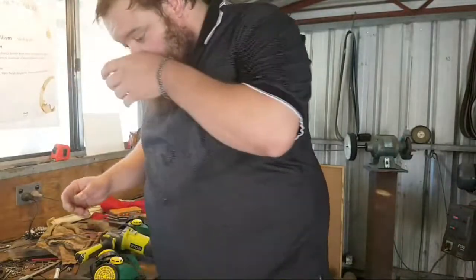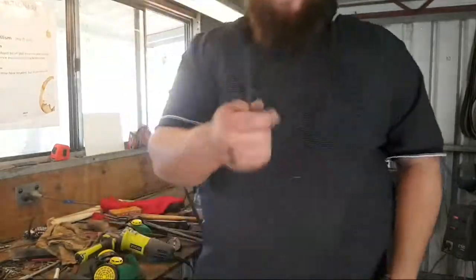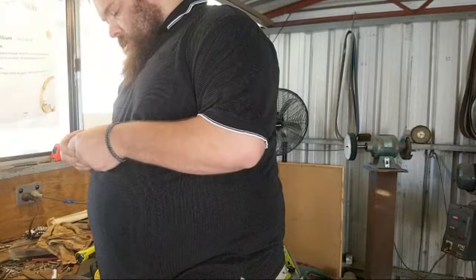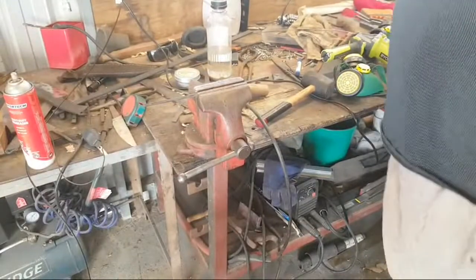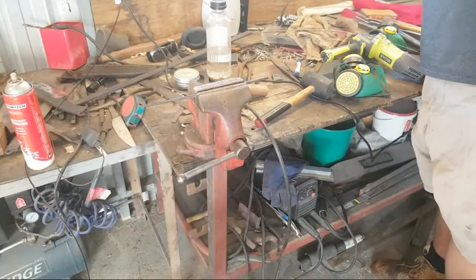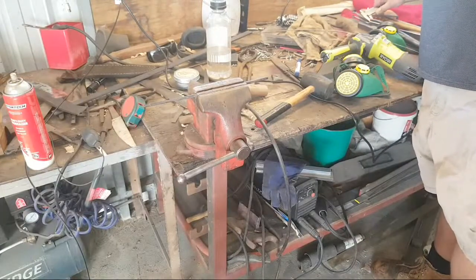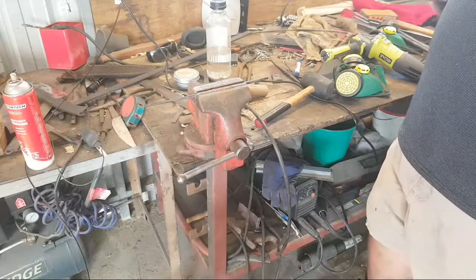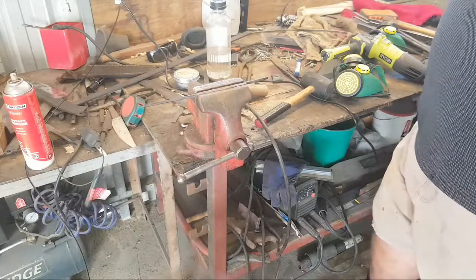Now we need 6mm rivet stock. Just a little piece of 6mm. And I've got it down to a fine art. I know exactly how long a rivet I need. 28mm. And the trick to that is to take measurement. So the thickness, the two thicknesses of your boss. Actually, this will be a bit different. For 6mm thick bosses, these are 7. So that's 14 rather than 12. So that's 2 extra millimeters, which is 30 rather than 28.